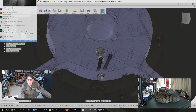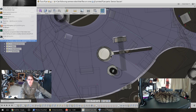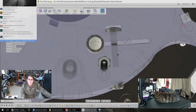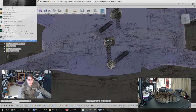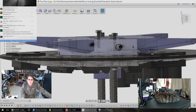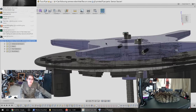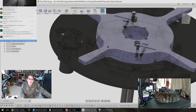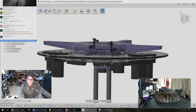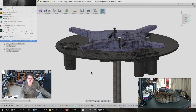And then it has a similar clamping arrangement where the carbon fiber rod goes through a pretty snug cylindrical hole here, and then there's a bolt here that applies some extra clamping pressure. And then these bolts additionally hold the sensor saucer onto this main clamped piece. And then there's also a little room for another piece above here that I haven't designed yet, which will mainly just be an aesthetic cover and a holder for some LEDs that are mostly for camera navigation aids. But yeah, the top will just be kind of whatever we want the top of the robot to look like, including LEDs or whatever.